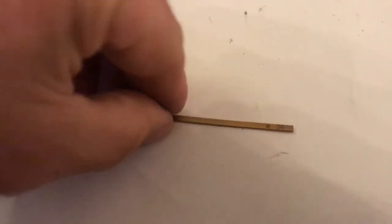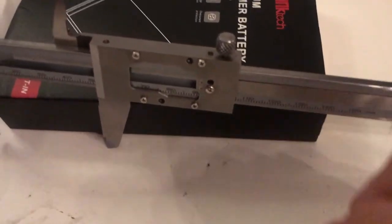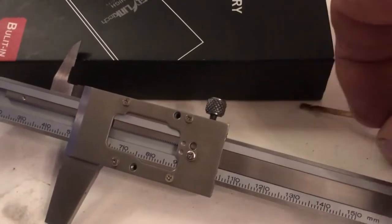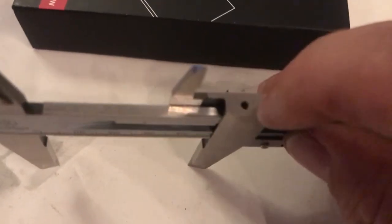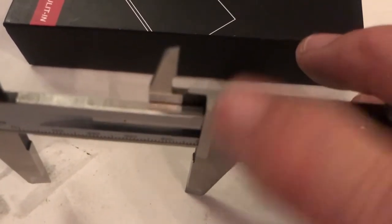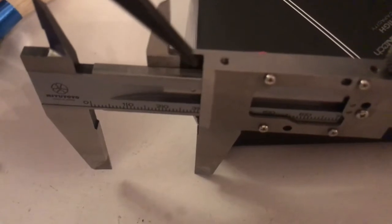I'm going to clean up this little shim — but remember it bends, so please don't straighten it. I imagine if you do that you're going to cause all sorts of trouble. Make sure the grooves are on top, and go in from this end. If you go in from the other end you end up hitting the inside and you can't get it in. We slide that in like that and it should slide in. There we are. Now I'm going to get that little grub screw with the pointed end in there — the pin will drop into the slot in the shim and you won't be able to move it backwards and forwards.